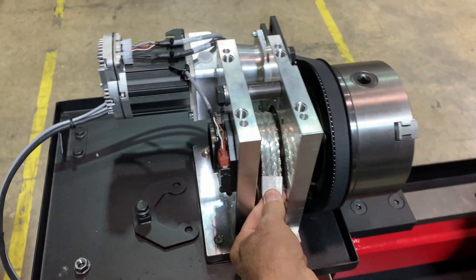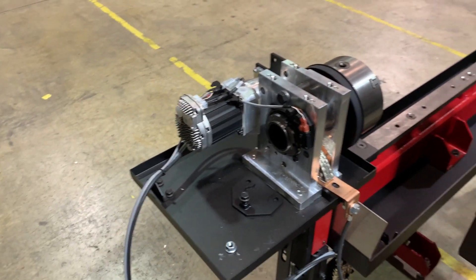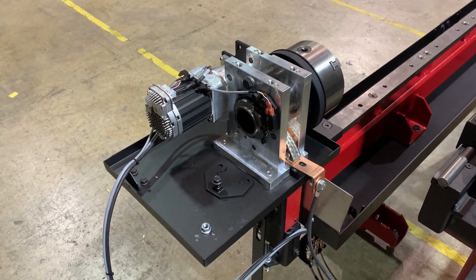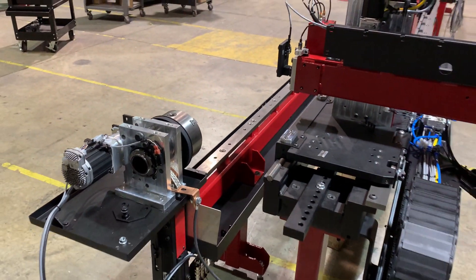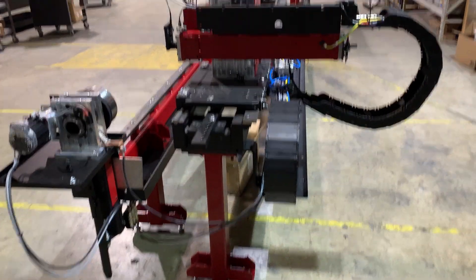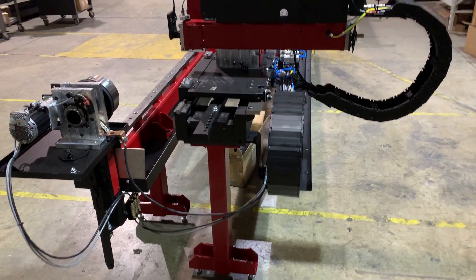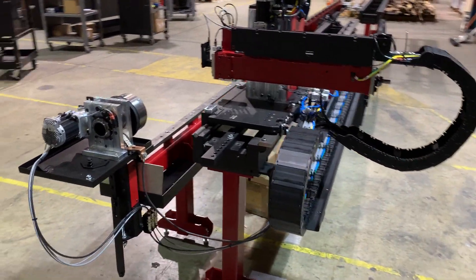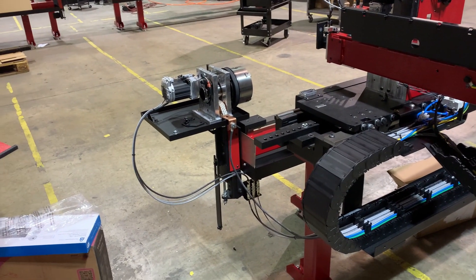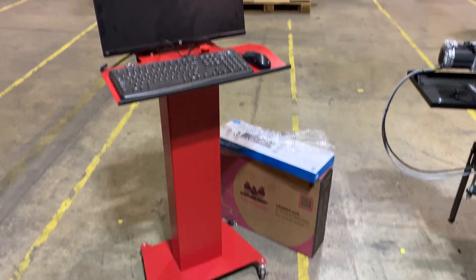That ground strap right there wraps around it. This motor — I can't tell you how many different motors we experimented with before we came up with one that handles three-quarter to six-inch pipe extremely well. We've upgraded the system so that instead of being limited to six-inch pipe, we now have a moment-of-inertia limit. For instance, we can handle six-inch pipe 20 feet long without too much trouble, but you can also now do eight-inch pipe — you just have to stay within a moment of inertia value. You can't do a 20-footer, but you could probably do a 12-footer.